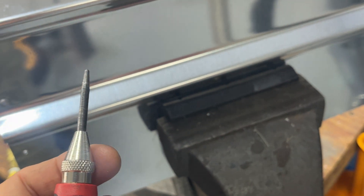Let's drill this thing out. The first thing to do is take your center punch and put a center hole right in the center of the rivet — there's already a little mark there. Now I'm going to pick up a drill and we're going to use the same size drill bit as we would use to drill the rivet. In this case they're one-eighth inch rivets, so we're going to use a number 30 drill bit.